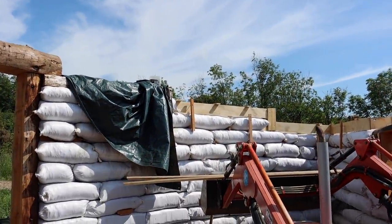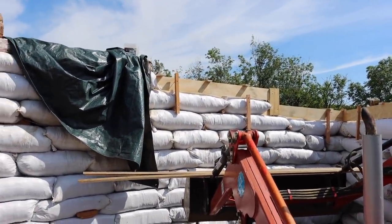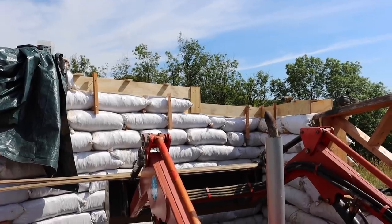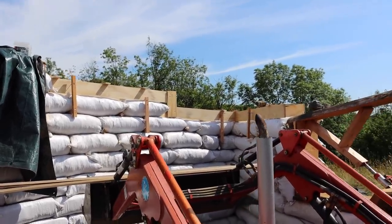Right, we're just doing the shuttering. We're doing 5 inches of concrete with rebar in it, and it's just basic shuttering, nothing special. And the end product's not going to look good, it's going to have steps in it and whatever, but it's all getting plastered. It's just got to be strong, that's the only criteria.